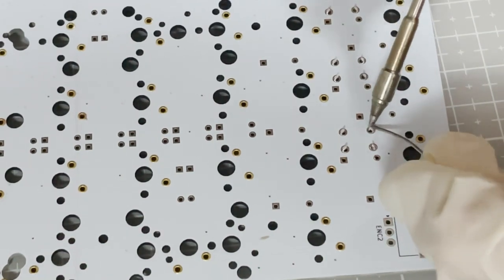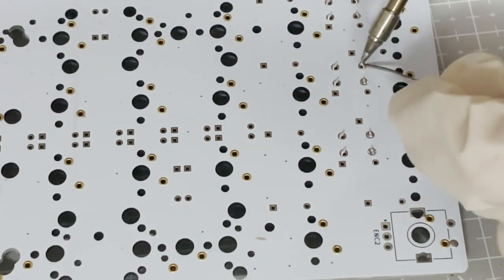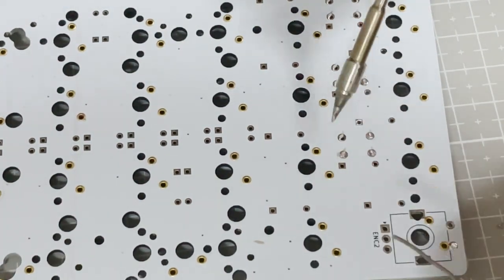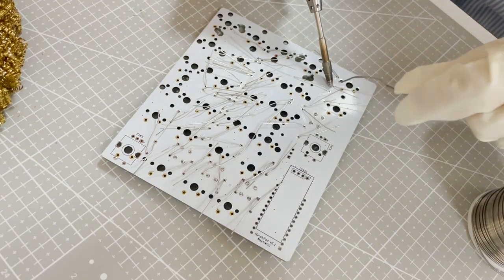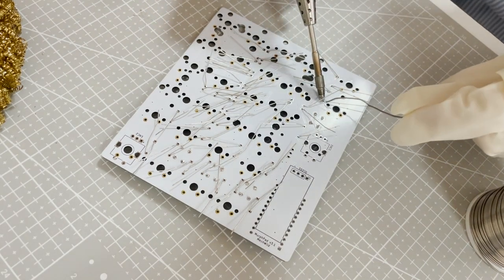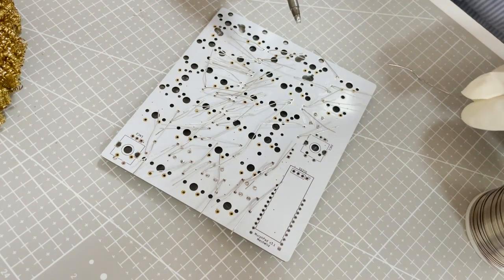Then, I soldered in the reset switches, resistors, and clipped the legs off the resistors. I also tried soldering in the LEDs, but I found it way too difficult. I was unlikely to turn them on anyways, so I didn't mind leaving them out. In hindsight, I should have bent the resistor legs a little more nicely so that the clipping wasn't as difficult, but oh well.